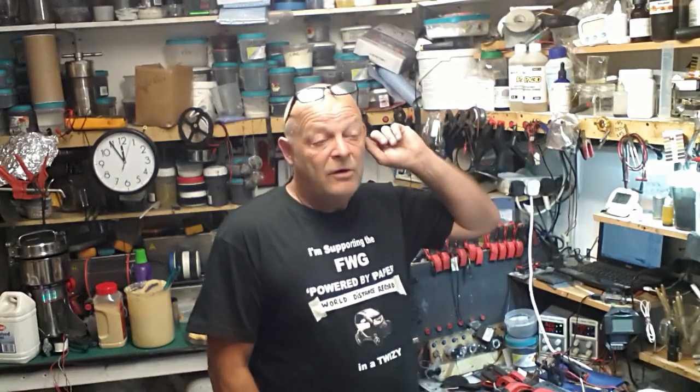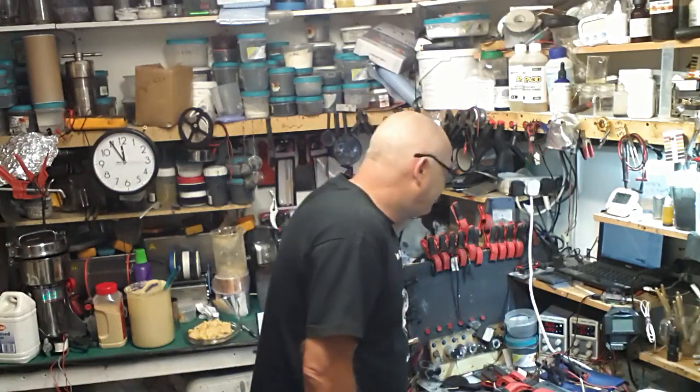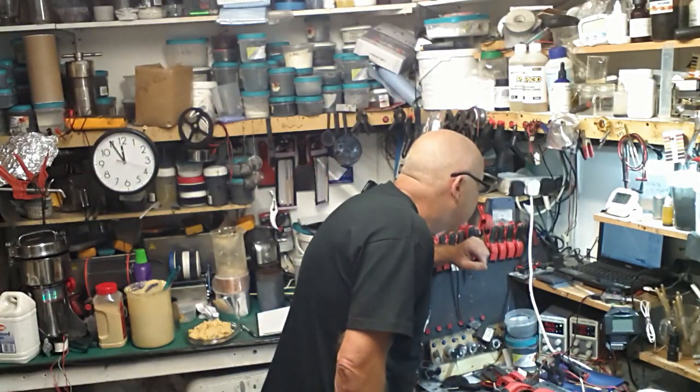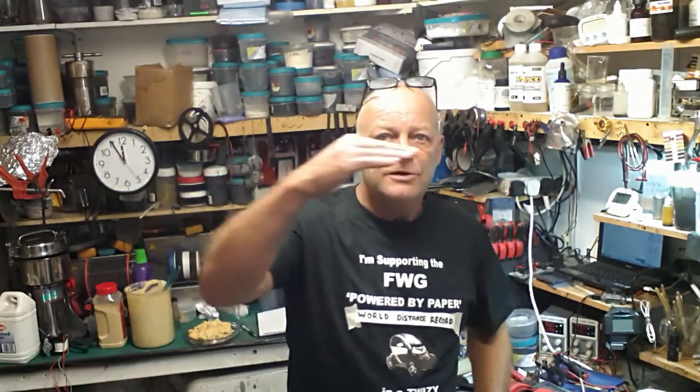Now you'd expect it to be quite high initially like that, because it's a higher load, just over double the load that it was before at 30 milliamps. So everything is as it should be. We've got a nice line at the moment, which will turn into a curve. And with this electrolyte, we tend to get that first big hump, it dips a bit, and then it starts again with another hump at the end. I need to look at that with the electrolyte and see what's going on, but I'm not going to do that just yet.